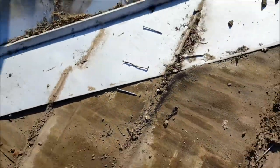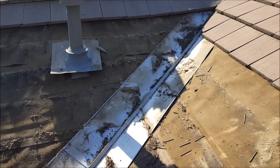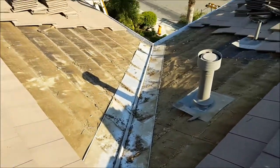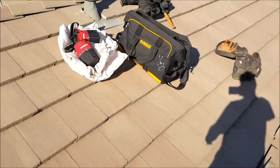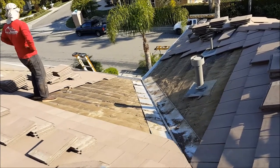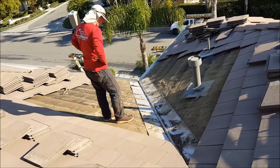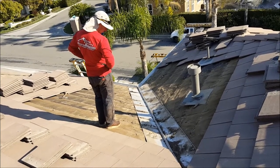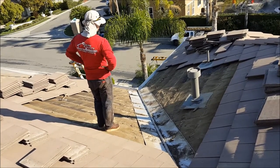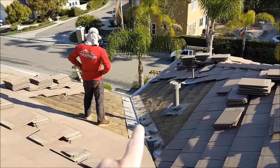You don't want people screwing around with your valleys — these are high water traffic areas that need to be done right. We're gonna sweep all this stuff up and bag it all up. We don't blow debris all over the property like most people do. We use recyclable bags so we're not throwing away a bunch of landfill trash bags. We'll remove the valley metal, cut everything out, check the entire deck, fix any problems, remove any mold, remove any dry rot, renail it, then do the ice and water shield, put the valley metal and paper back — everything back to the way it was. This valley will never leak again. This area on her roof will be the last area on her whole entire roof to ever leak again — that's a promise.